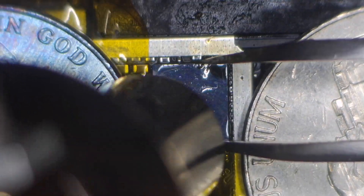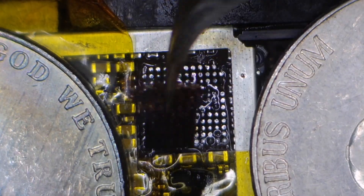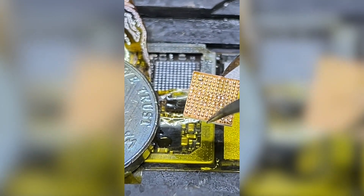After a few seconds it just pops right off. Then I'll add more flux and clean it off with my desoldering wick and some more heat. So 90% of the time, it's not actually the chip that's bad — it's four of the connections underneath.